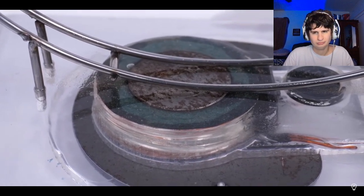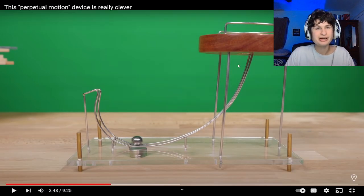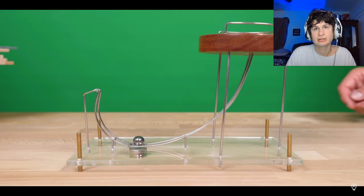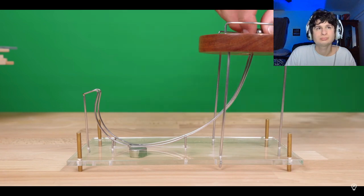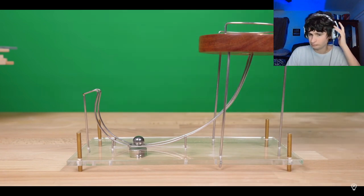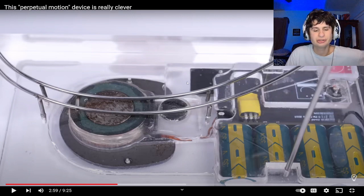But that's not enough on its own. If you simply turn on the electromagnet, the steel ball will accelerate towards it. But once it reaches the electromagnet, it'll be harder to leave. This is what happens when I put a permanent magnet in place of the electromagnet. So the electromagnet needs to be on during the approach and then off once the ball reaches the magnet. We guessed it right guys — electromagnetic. Pretty fancy, straightforward kind of stuff going on here. That's where this component comes in.